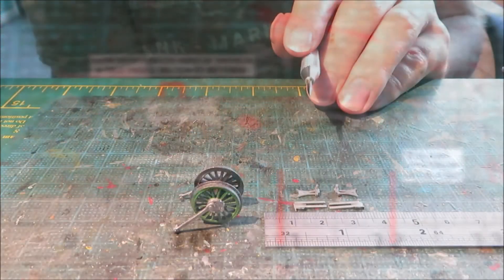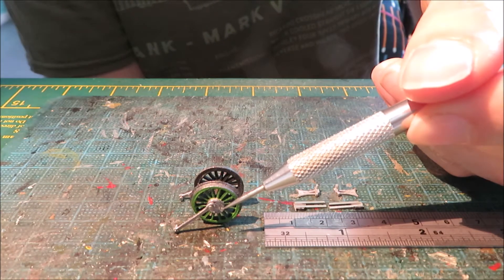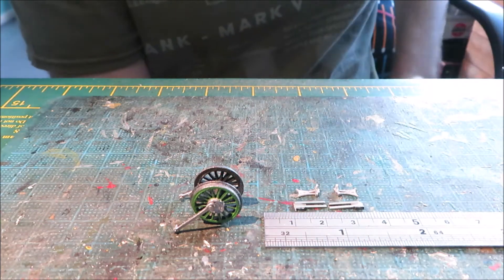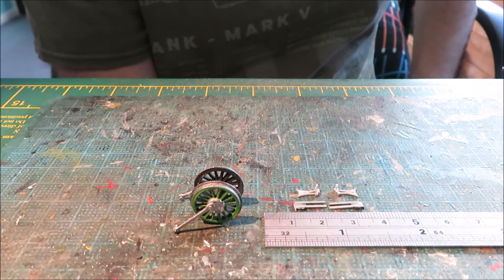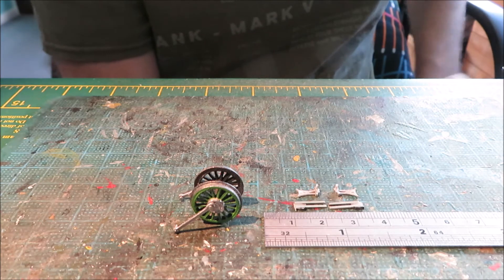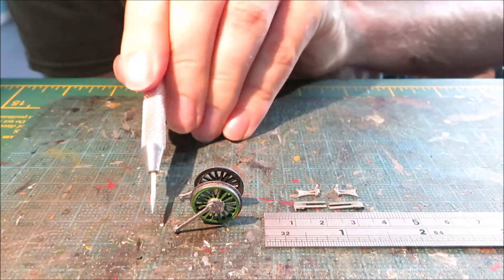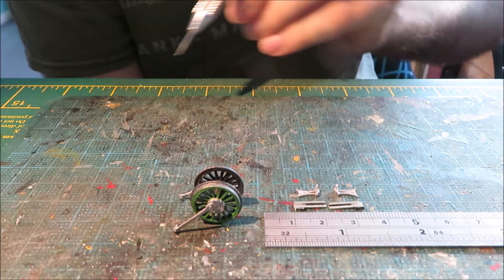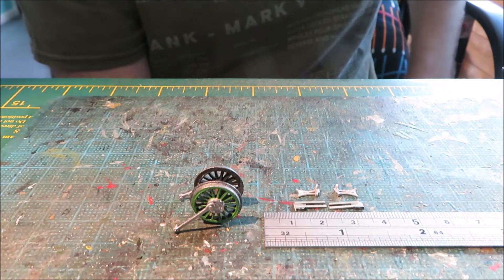Turning to the driving wheels. A little bit of sanding on the flats of the eccentrics is to be advised. Similarly, sanding down the coupling rods as much as you really can. You need them to be strong of course, and they are deliberately printed in a versatile strength plastic, but again there is this question of clearances. You'll see that they're pinned in place and there are pins on the insides of the two parts.